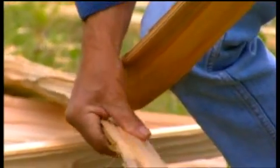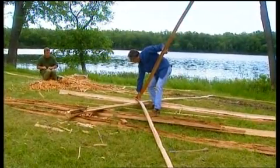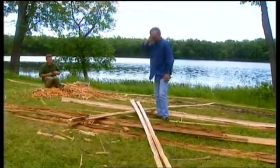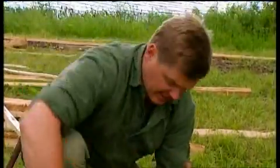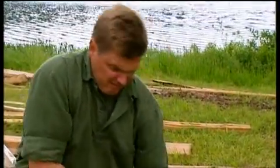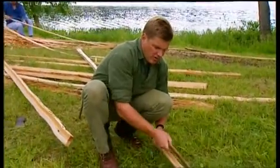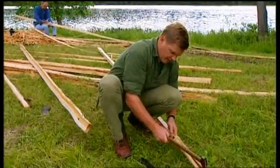When you do things traditionally, that means making the jig you'll use to build the canoe as well as the canoe itself. So more splitting, but with the right materials, it's incredibly straightforward. I've never worked with cedar before. It splits better than any wood that I have worked with, even better than sweet chestnut. And of course the principles for splitting out bits of wood like this and keeping the split running true are universal. It's a lovely wood to work.